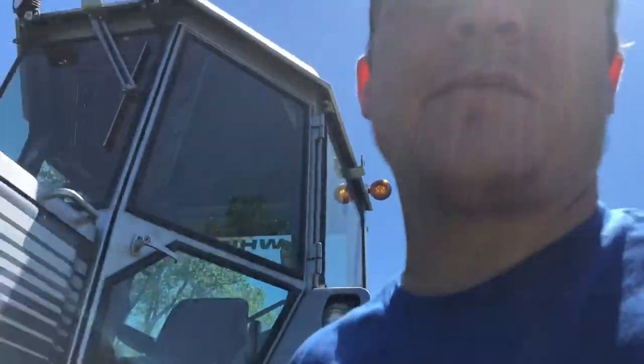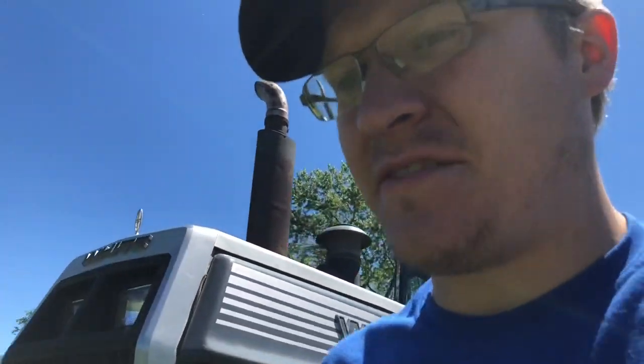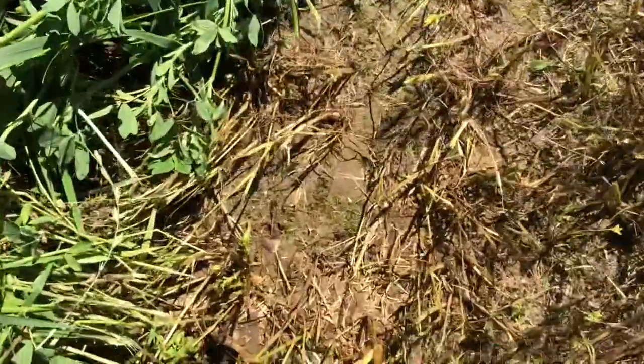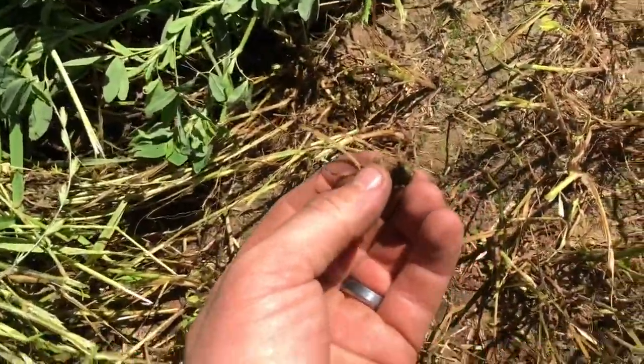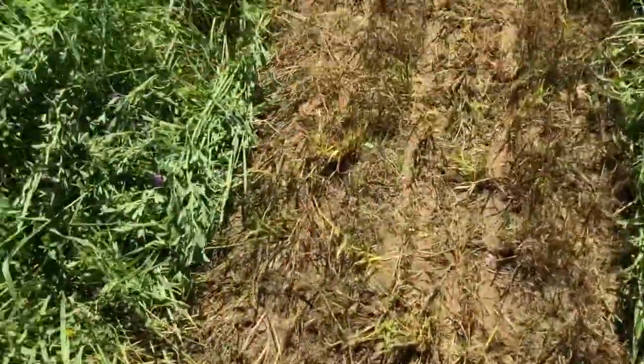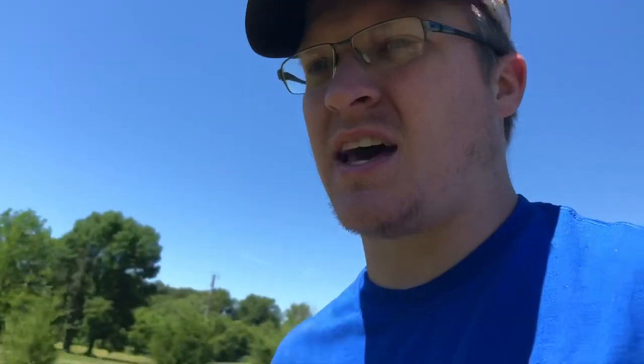Just made two rounds around the field. I'm just going to check everything, make sure everything's doing alright. Check my cut height — I thought I had it as high as I could go, but I don't think it is. Especially on first cut, I like to get it as high as I can cut it. It gives me a little bit more stubble for my hay to sit on because the ground is always wet. You can see here, this is a pretty high spot in the field and that soil is very moist. So I'm going to check that real quick.